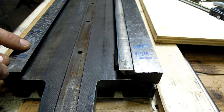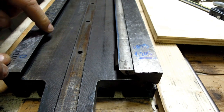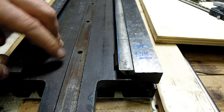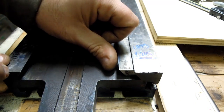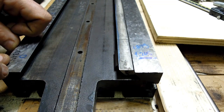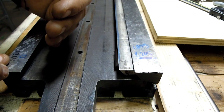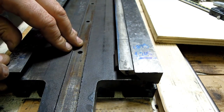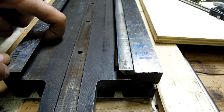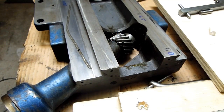and this side's got 1.6 thou wear in the center. So it's very uneven wear, and to be quite honest, I was surprised about that. This steel on cast iron interface wore more than the cast iron interface. I mean, maybe it worked. I don't know what this thing used to grind in its past life, but maybe it worked up against the back of this gib more than it worked up against this gib. Hard to say.